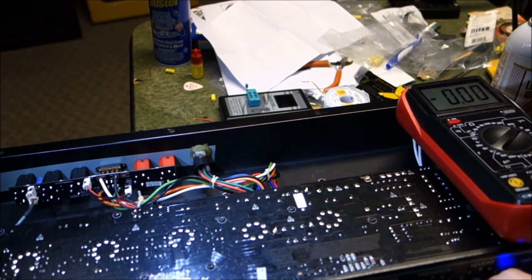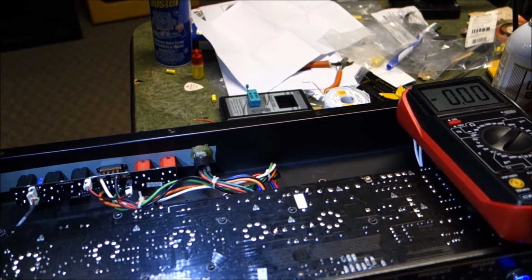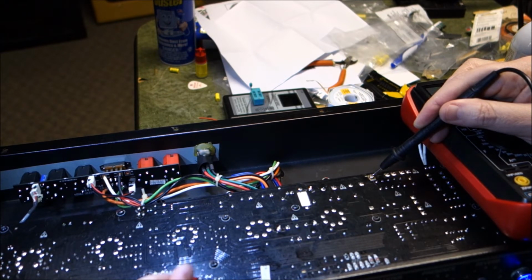Interesting. Now if I have that reverb turned all the way up, I'll turn the amp up so it's amply loud. I would think I could hear poking around on these pins. If I hit one of the audio pins from that, I shorted something, I think, for a split second. That one right there. That pin right there, I can hear it when I scratch. So I'm going to bet that's audio output.